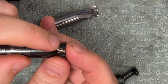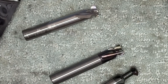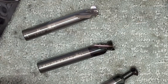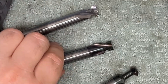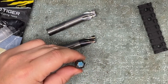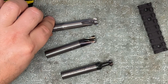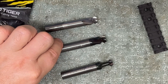Third, the depth of cut below the Picatinny section — the flat section at the bottom — was optimized for most use cases of a Picatinny cutter. It was kept short enough so it doesn't stop you from doing more niche use cases, but long enough to cut the flat section for most use cases in one single toolpath. Fourth, the flute geometry on both cutter styles has been optimized for aluminum, covering almost every hobbyist use case and the vast majority of professional use cases as well.